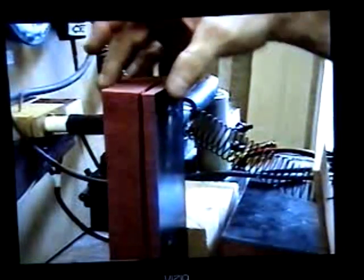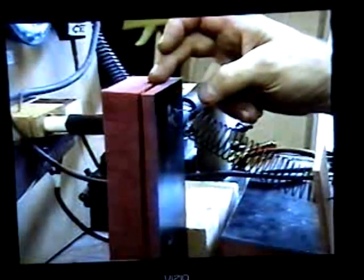Right now I have the stack set at five inches of vacuum. You'll notice that the Winker pneumatic is fully closed - the equalizer. Were I to decrease the pressure of the stack just a half an inch, you'd see the equalizer start to open. That is correct.